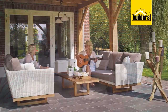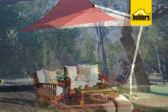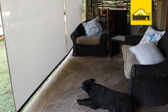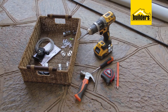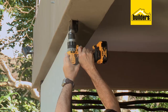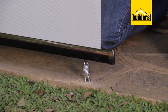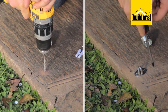If you don't have space for an awning or already have a roof over your patio, there are cool umbrellas and sails that need no installation or very simple installation. Patio blinds are another great way to turn your patio into an outdoor living space — they offer privacy from the neighbors and protection from the elements. Installation requires just a drill, screwdriver, hammer, pencil and tape measure. Simply measure and mark, drill the holes and install the mounting brackets — the blind slots into the bracket. Anchor points and springs supplied with the blind are installed at the base on the patio floor to prevent it flapping in the wind.